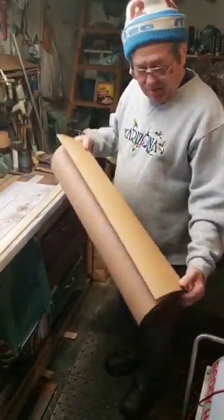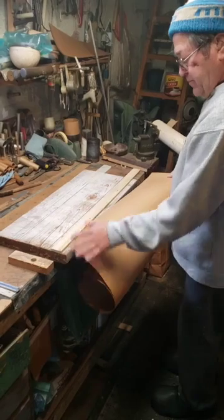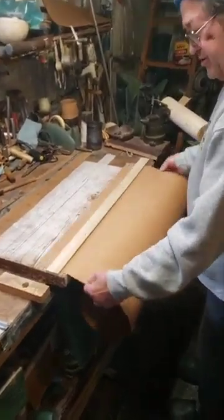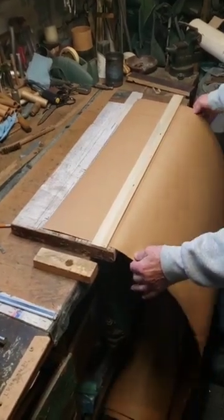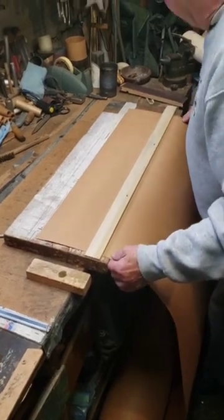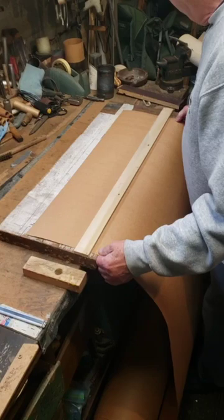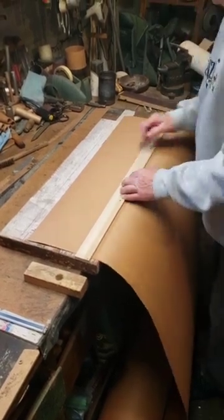This is 12,000th paper — wrapping paper that we used to use in the mill for wrapping calendars. This is my cutter, a very simple device with no moving parts. All I do is slide the paper underneath there, let it drop down on the floor, and my 5 and 5/8 inch width sheet that I want, I just line it up with the lines that I've got here. That's how long the tube is.